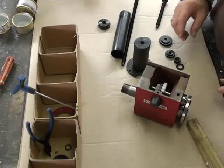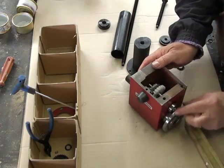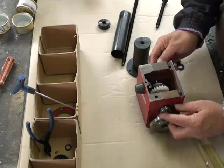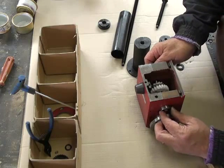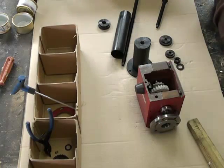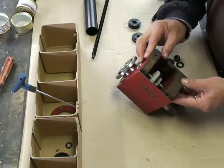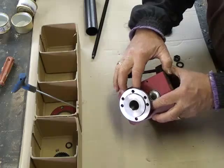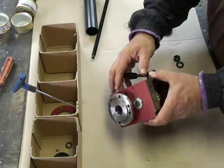At this stage I've tapped the high-low shaft out, but it won't come off because of the flange. The instructions from Micromark tell you to remove that - it won't work while the flange is still on. For now I've tapped the high-low shaft back in so it's not in the way. When you tap it back in, the plastic bearing cover has to have the little C cut out in the right place, otherwise it won't push in.